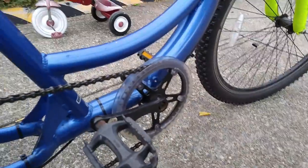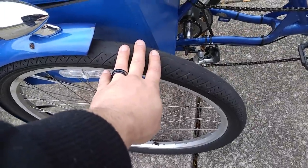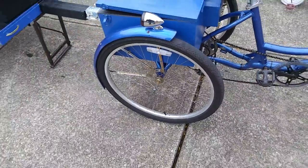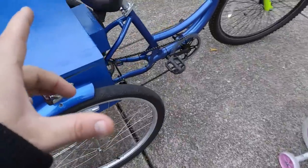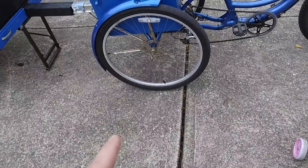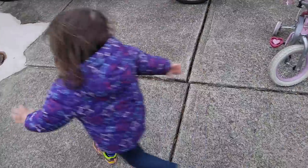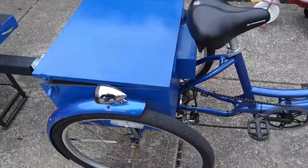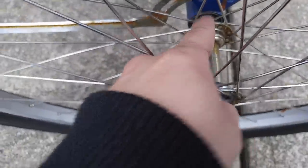That's where our fans go in there. This drive rim right now is completely shot — it's bent all to pieces — so I'll be going with the same company I got these from and ordering two. They're two and three-quarter inches wide, so they're much wider tires and they'll be designed to handle 375 pounds apiece. I'll just weld the axles right to the center of them so they'll slide right in through those bearings.